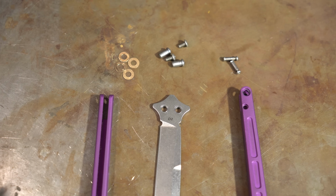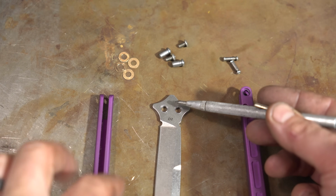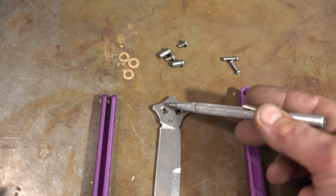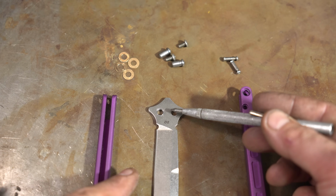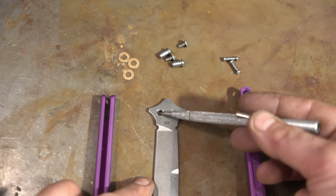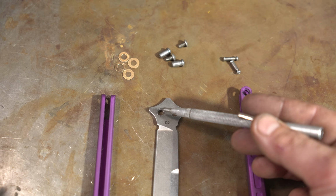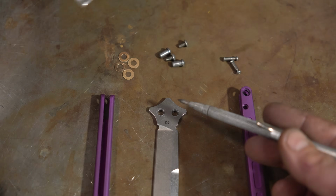All right, I've got this guy apart. Let's go over it a little bit. So first thing is the blade. We've got this shape, but it's got bushings. These are little bushings that just sit in there with friction. And I measured these, and these are a 1/4 inch outer diameter and 3/16 inner diameter. So I went and bought precision bushings that are that size.